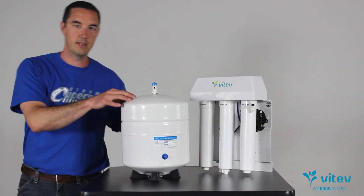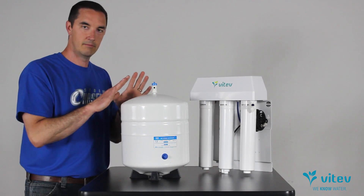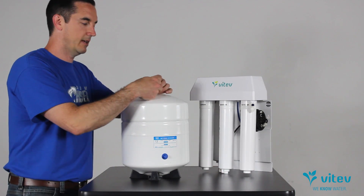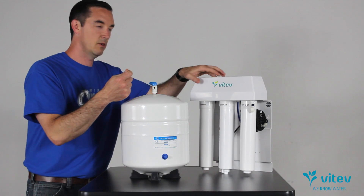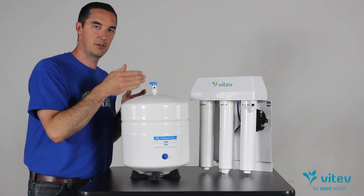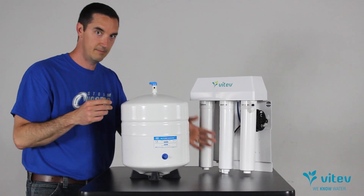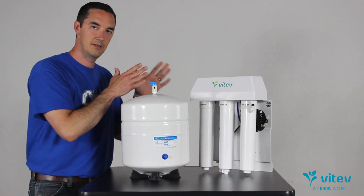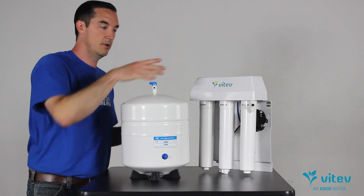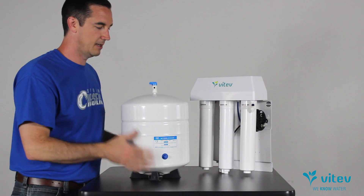To diagnose the tank, number one: drain the tank. You can't check the pressure or diagnose it without the water being gone. So the first thing you want to do is turn your faucet on and let it drain out. Once there's no more water coming out, turn off the valve on top and disconnect the tube that heads into the tank. Take that out and wait a few minutes. What you should see, as long as the RO system is still functioning and the faucet is off, is water coming out of that tube. It may spurt out a little bit or trickle in chunks because the membrane is pretty tight and it takes a long time for water to seep through. What you want to look for is water coming out — if water is going through the entire system without a problem, then your issue is probably the tank.